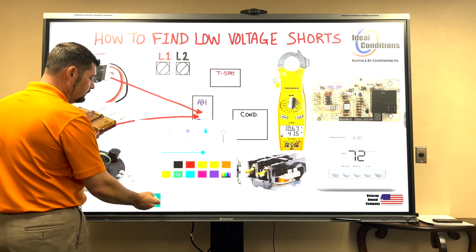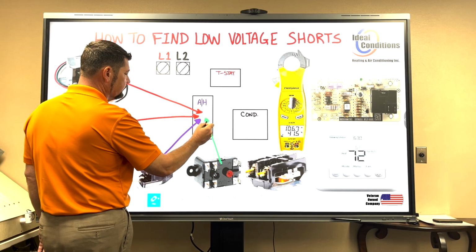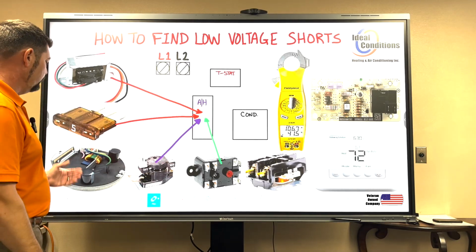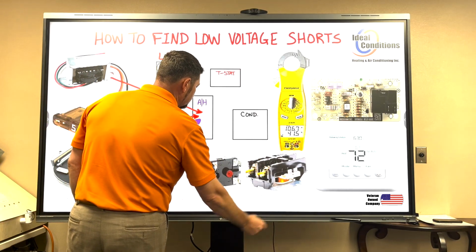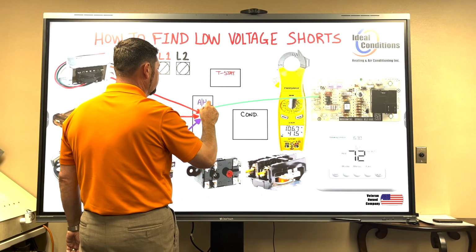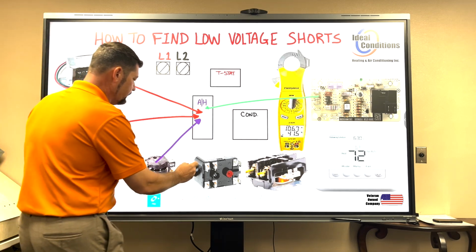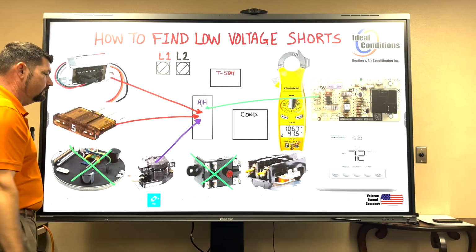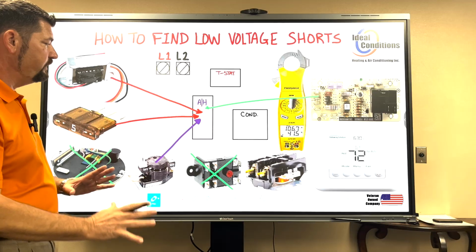Then we'll say the blower relay is found inside the air handler. Now you're not going to run a blower relay with a module, but if I wanted to take that last step out, I can say that this blower control board is found inside this air handler. Okay? And that means we're not using this, and we're not using this. I'm marking these green because your G call will control these. So I'm trying to keep everything very color-coded here.